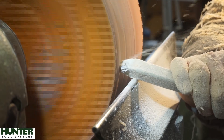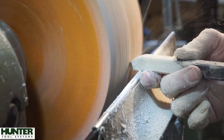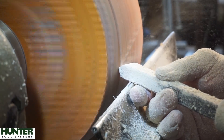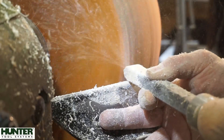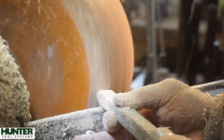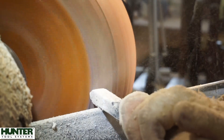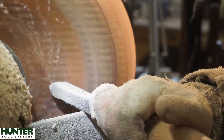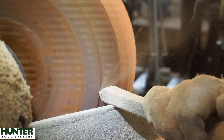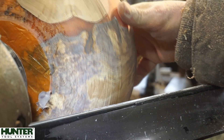When I put this in the casting bucket, I realized the downside was going to be the bottom of our bowl this week. That's why I put the majority of the wood down in the very bottom — that way you're turning away wood rather than resin. I knew that the resin was going to drop in the casting. The whole bottom part of your bowl is going to be a good solid casting this way; if it's the other way, then it's kind of iffy.